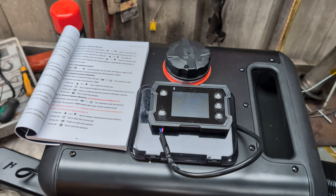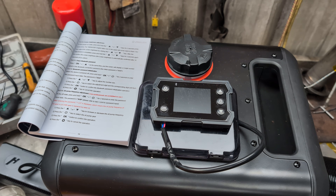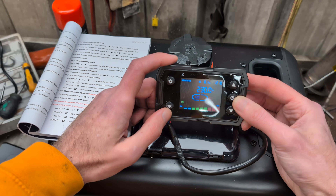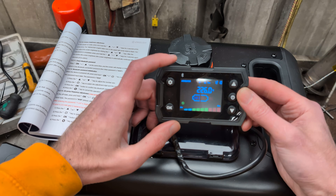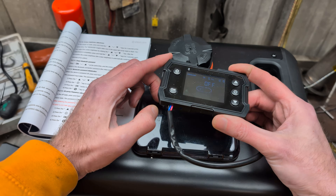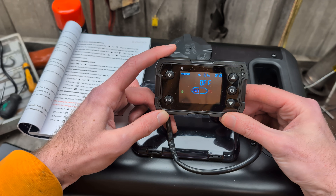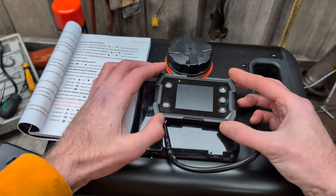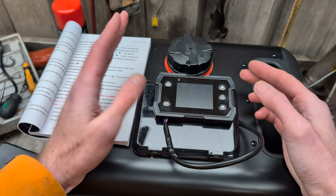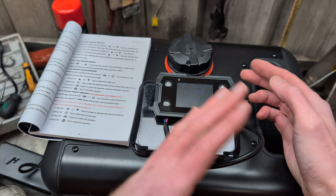This is the exciting and time-consuming process of tuning a diesel heater. You'd have to go back in, go through them all again, and turn the pump down another little bit. Basically you want it sitting where you've got the least carbon monoxide but still a good amount of heat. Now, there is a problem you may run into if you turn the fueling down too low: the burn chamber cools too much and ends up sort of partially going out and then reigniting.